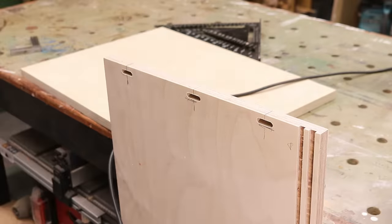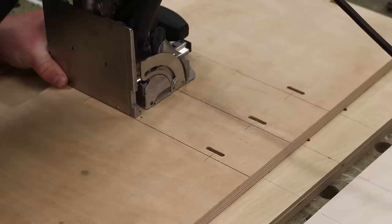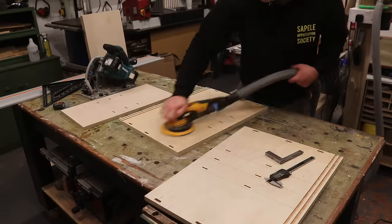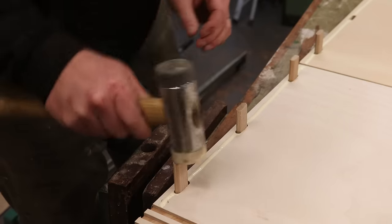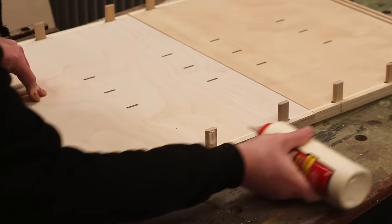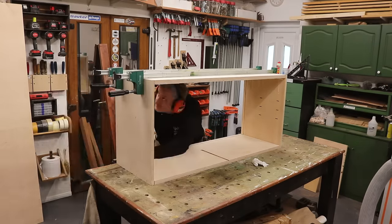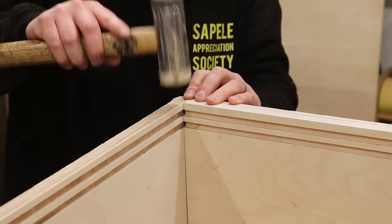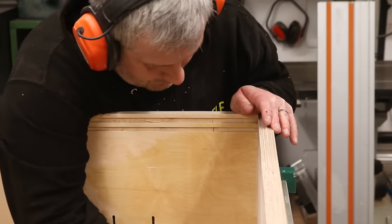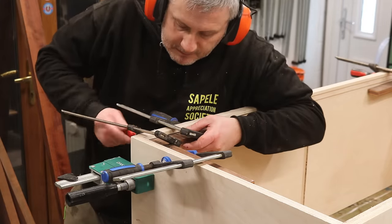At this point I decided it would be good to have some adjustable shelves and I had the idea of using dominoes to make shelf pins — I made a separate video all about that too and I'll leave a link in the description box. I can then sand the inside faces of the cabinet and finally start to assemble the carcass. When I cut the dominoes earlier I made sure to do it on the medium width setting so that I can get my housing grooves at the front perfectly aligned. I added parallel clamps before wiping away the excess glue with a damp cloth and checking for square by measuring the diagonals. It was a little off so I added some plywood squares at the corners just to bring it into square.